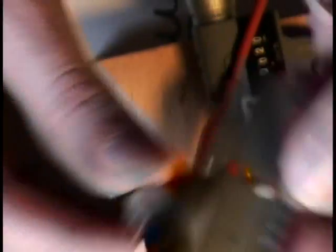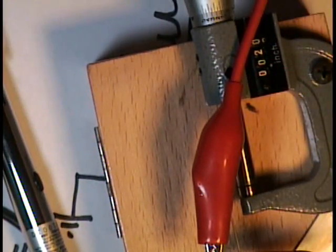It's very good for going through hard materials. You can also use different types of electrodes — you can carve out an electrode in graphite in a particular shape and have it slowly carve its way down into a block of steel. They also have a wire EDM, which has a constant feed of wire that's moving on a kind of plotter, slowly sparking its way through huge blocks of stainless steel or other materials.